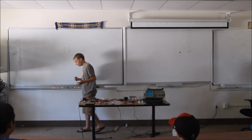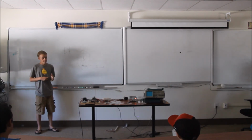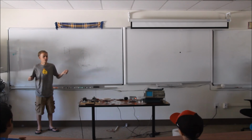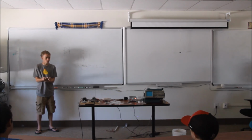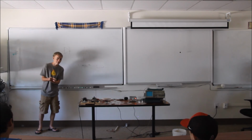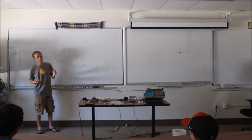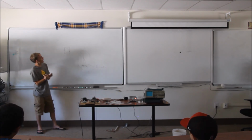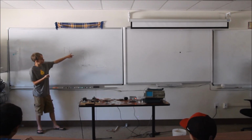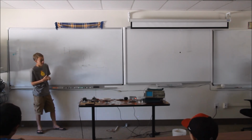They can also be used to protect something. Like if there was a device that you could plug in backwards into a DC voltage, and if you plugged it in backwards, it would fry it out. These diodes would make sure you could never plug something in backwards, because if you did, the electricity would just flow through the diode and not go through the device at all. It's kind of hard to explain.